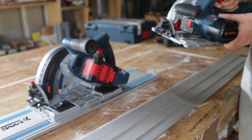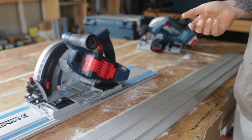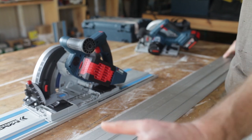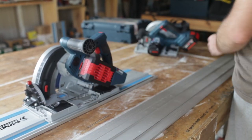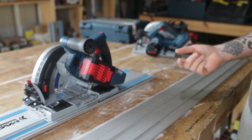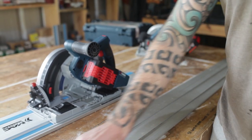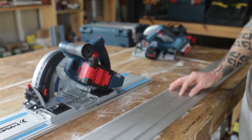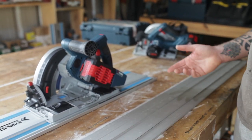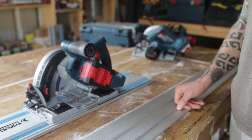This is a very, very nice track — it's 1.6 meters in length. Plywood in Portugal is 1.25 meters wide, so you can do cross cuts very easily with enough space on either side for the saw to clear. Sometimes with other tracks there's just barely enough for the blade to go all the way through, so 1.6 is perfect instead of 1.4. You can also join these tracks together using a special fitting in the T-track slot — if you got two 1.6m tracks you'd have 3.2 meters, which I don't think anyone would need more than.